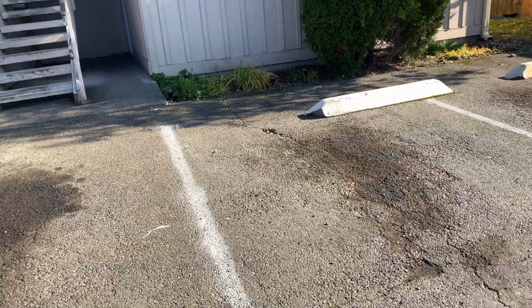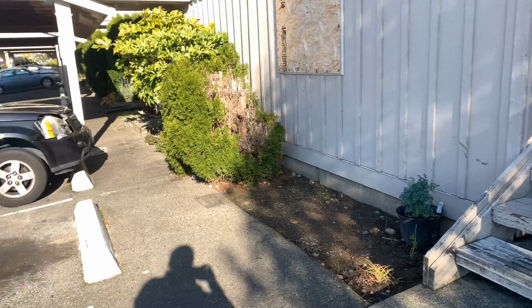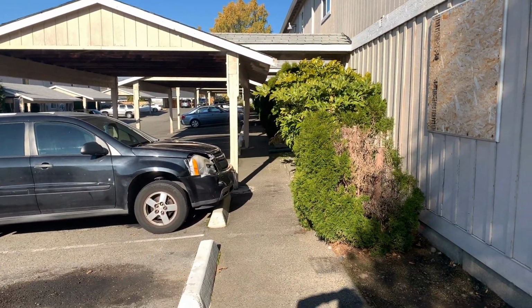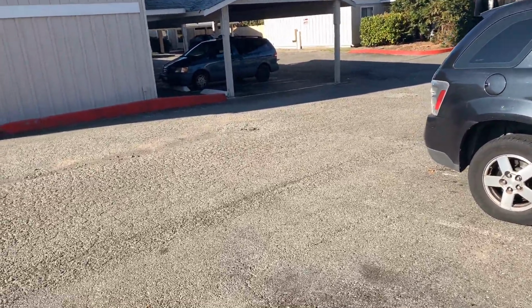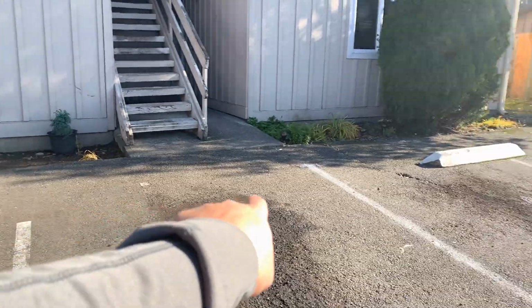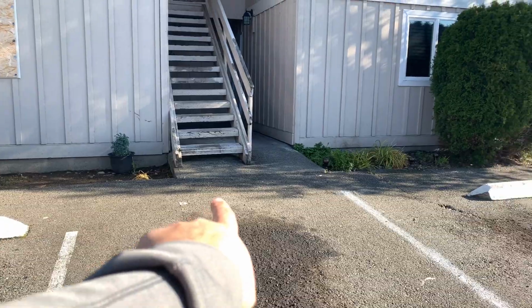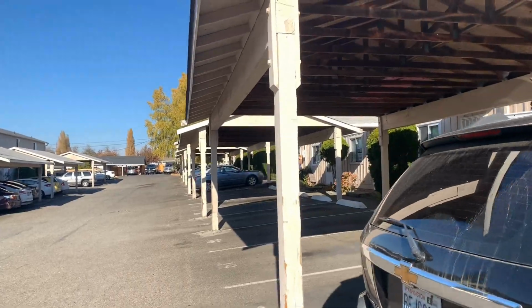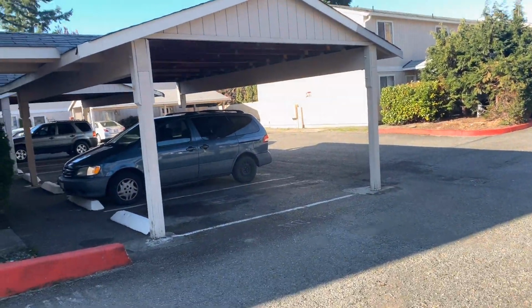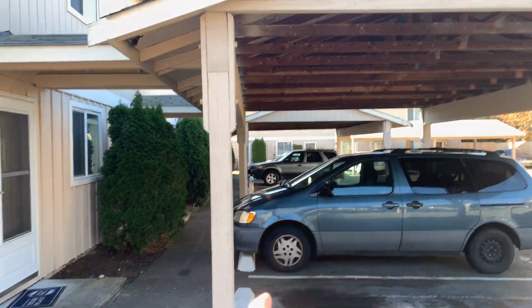But as I'm looking at it, with the exception of this spot and that spot, all this asphalt looks pretty good all the way down. And I don't know why we would be replacing it. I'm going to suggest that we go right up to the front of these wheel stops. There might be a couple areas where we got to go in a little bit, but I'm going to say we go in front of all the wheel stops here and not remove any of these wheel stops. We just do a cut right down the front because this backside looks good.